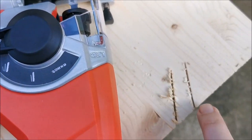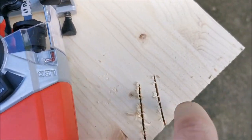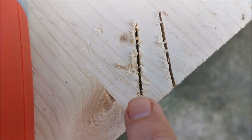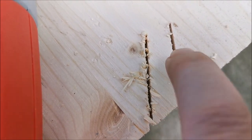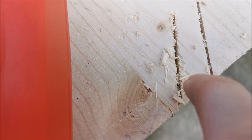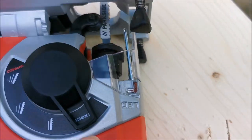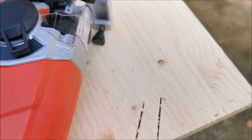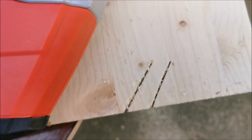I did two small initial cuts to get a feel for the cordless tool. One cut was with exact mode and one with speed mode. In this softwood, speed mode cuts two or three times faster, but the result is way worse. In exact mode, cleaning up the cut gives you a decently clean edge. In speed mode you get a much rougher result. On the bottom side the cuts are quite similar between both modes.